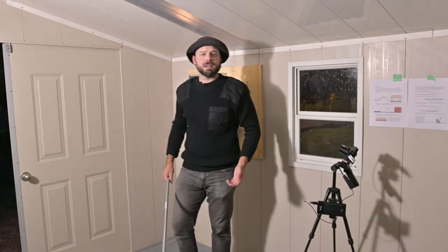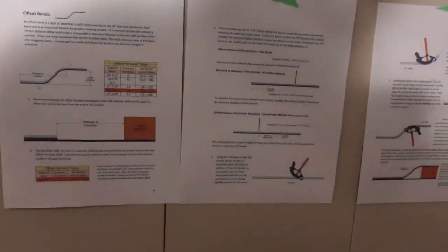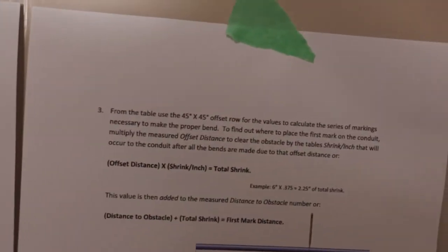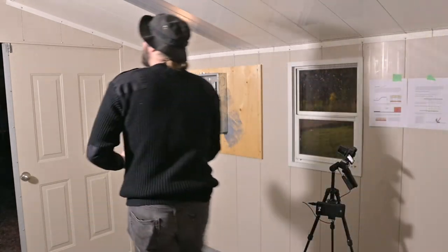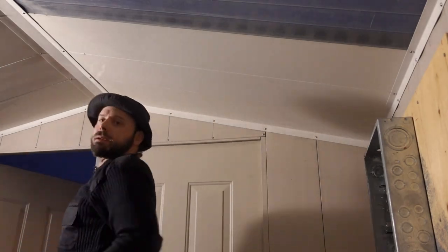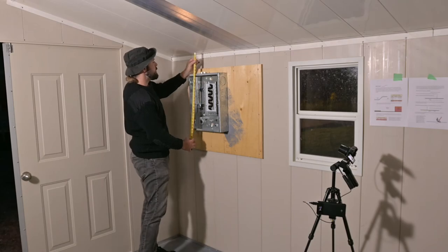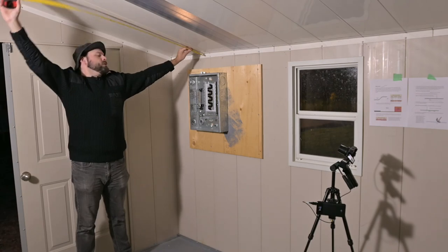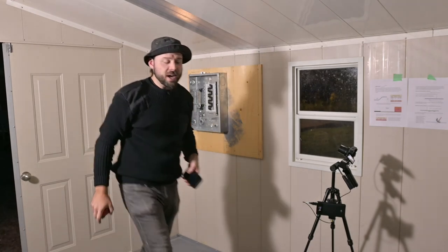EMT is fun, half because I'm a computer geek and, you know, hard tubing. Except I've got to remember how to do this. I printed out the instructions — there is going to be math and equations involved in doing this. You don't just bend her up and give her. One of the first challenges is I need a junction up here somewhere to get to the lighting, so I've got to figure out how to get that pipe up there. From here to here we've got about seven inches, and here to here, 58 inches. Seven plus 58 — that's a total of 65 inches.